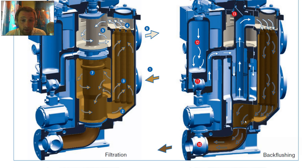The best thing, if you want to clean central coolers, and I have seen this in action, is that there must be a specified set of valves — such a system — so you change the flow for some time, about 45 minutes. With that change of water flow — not air, nothing else — but with specified valves which are designed for back-flush only, you can achieve a real cleaning effect and it really really helps. I have seen that. But if the system has no such valves, you cannot do it. The only trouble you will make is to make the central cooler even dirtier.